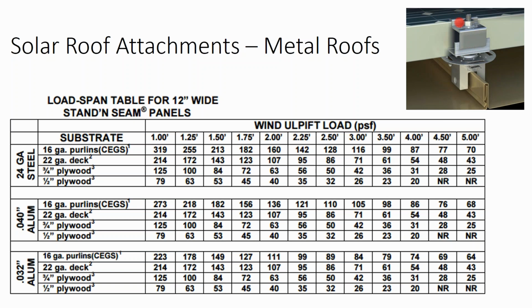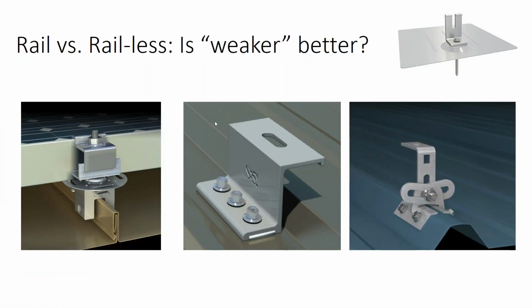It was kind of annoying, lots of clipping, but you had to because of your pull strength. And I think that's a common mistake. You read the manuals for standing seam metal roof racking systems, and they tell you to put a clip on every single seam. When I'm doing Versa brackets and I'm going into the purlin, that's a much stronger attachment that goes directly into the rooftop. So that's when I'm going back into 4-foot on center, staggered.